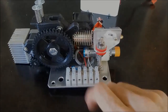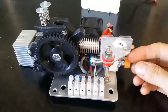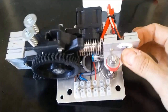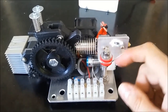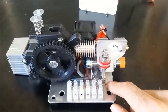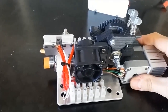There's a thermistor, proximity sensor, and fan connector. There are also some fiber washers and a 6mm threaded rod to help support the head assembly. Without that, if the printer got a knock on the nozzle — which can happen with ABS warping — it would just snap off the whole head assembly at the point where it goes into the heat sink barrel, which is really thin there. The fiber washers insulate the heat away from the threaded rod and the back plate. It's also got two 40 watt heaters — around 80 watts total — to get the plastic heated quickly.